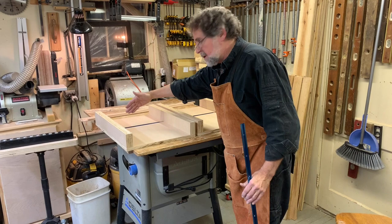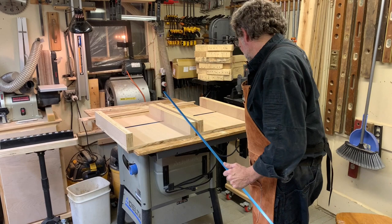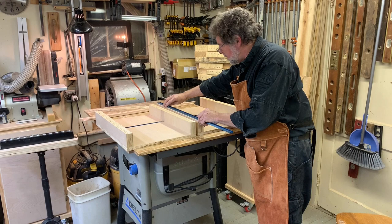I've got these mocked up just so I can get measurements. I've got them cut to fit - luckily this is aluminum, easy enough to cut with a carbide blade, just be careful and take your time. You saw me do a little sanding work to get rid of some of the rough edges. Now the next step is to rout a dado in the top of this so I can mount a piece of track.